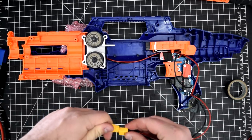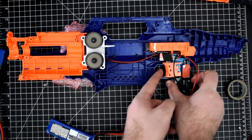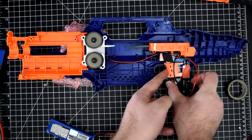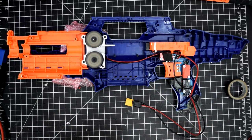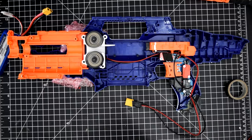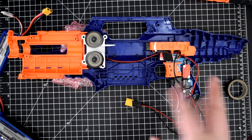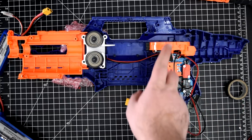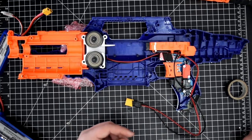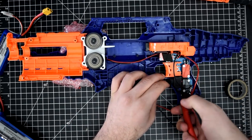It works with 2S just as I would expect. That's how all my rapid strike builds react — nice single fire and controllable hold-down fire. On 3S, the pusher is probably going way too fast. If your DPS is over 10 or 12 with a live center circuit, this can cause a runaway.